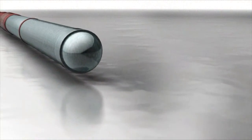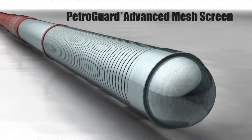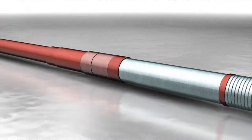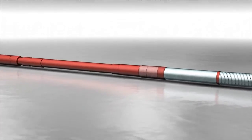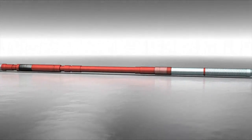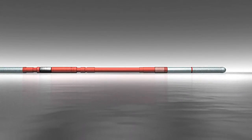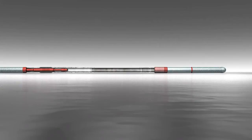ZoneGuard systems are also a key component when running Halliburton PetroGuard screens and Equiflow inflow control devices. When screens are required in a completion, an isolation setting tool is necessary since the tubing cannot be pressurized. The isolation setting tool is run inside the ID of the ZoneGuard packer and will indicate into a lower sub, spaced out below the packer.